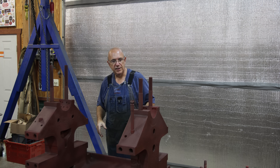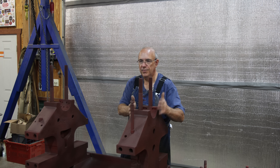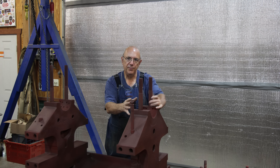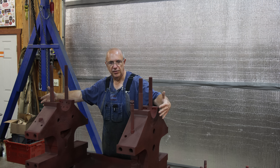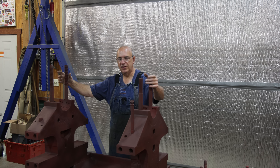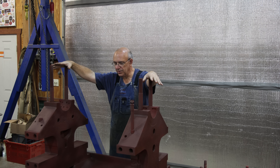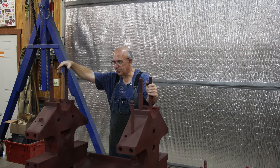I've gotten some thick wall tubing that's five and a half inches in diameter on the outside. I've got two pieces and we're going to cut them to fit in here. I cut some plate that I'm going to weld up on the ends of those, drill a hole all the way through, and take a piece of bar stock we'll turn on the lathe to basically tighten it up. It's going to look kind of like an old barbell — two bigger pieces on the end supported by a shaft coming across. So that's my plan today: get that built, make the spacers to support the shaft and dam it up, and then we'll be ready to pour these bearings. But first, let's build the mandrel.